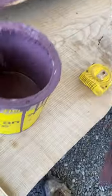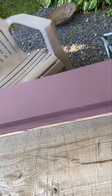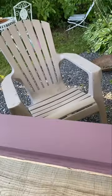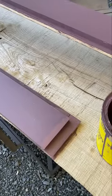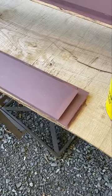Now, if you're a woodworker and you're installing trim, you guys need to prime the end grain. You want your stuff to last, you need to prime your joints. Now, it doesn't take long, but the longevity that this adds to your work is astounding. Now, let's say you don't have the primer, use wood glue, waterproof. Whatever you do, do not put end grain butting into something. Guaranteed to rot out, I don't care how good the wood is. In the wintertime, I'll use polyurethane because it will not cure, but come the warm temperatures, it will, and it seals the end grain. A very important step.